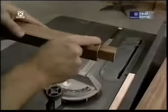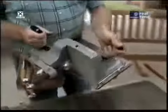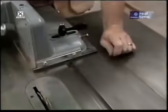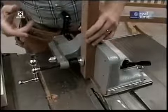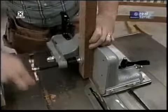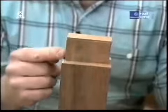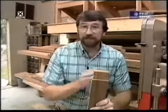The next thing I want to do is make this shoulder cut. This is a tenoning jig made by the manufacturer of this saw — every manufacturer has their own version. This one rides in the same slot as the miter gauge; it's heavy cast iron, very well built. It allows you to hold pieces of wood in a vertical position, clamping them quickly, and cutting very accurate tenons. Best of all, it's very safe. I've just removed the material along the narrow side of the tenon — I could nibble that away or use a hand saw, but the bandsaw is just quicker.